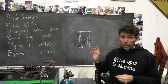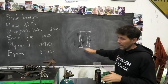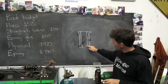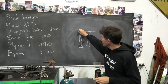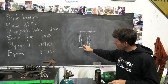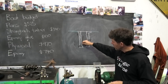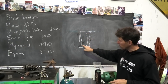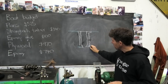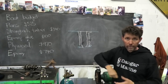Before we wrap up, let me show you quickly on the board how the final locking stage works. The lower part of the thread inside the block isn't quite as deep at the bottom. So as the tool comes down, when it gets to that point the tool is actually wider than the bottom section, which pushes the bottom of the insert outward to lock it into the block — and that's what makes it stay there when you wind the tool back out.